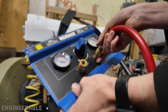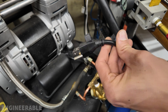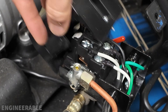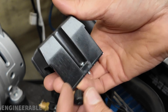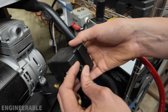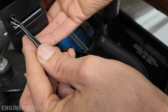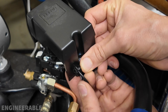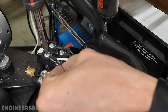I had to remove the whole front panel in order to get to this switch. Make sure the electricity to the compressor is removed before opening this switch. I'll strip these wires back a little bit further. To the cover I'm going to add a hole for a small wire grommet so the wires are well protected when they pass into the enclosure. The top level is the compressor side of the contacts, so that's where I want to wire the solenoid switch in — I'm just going to stick them under here.